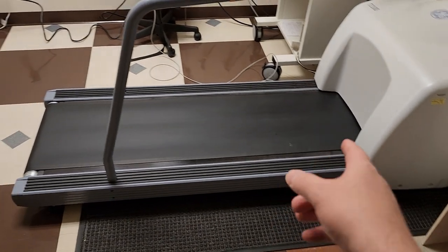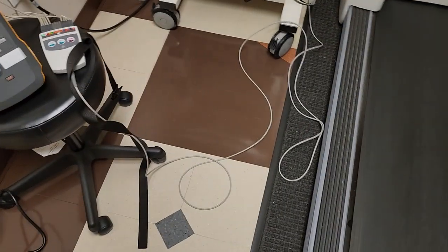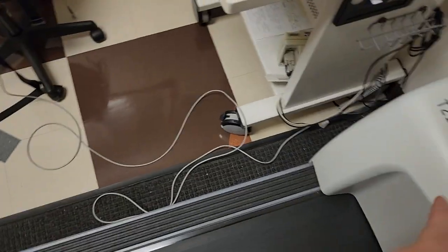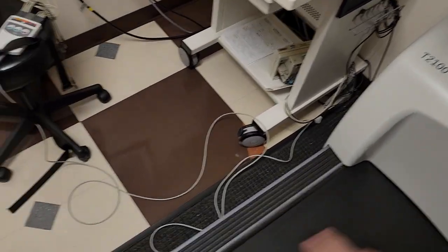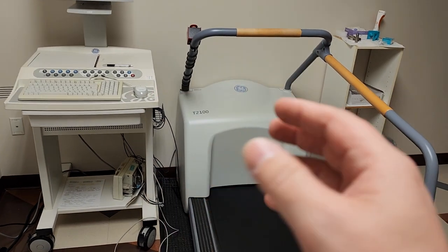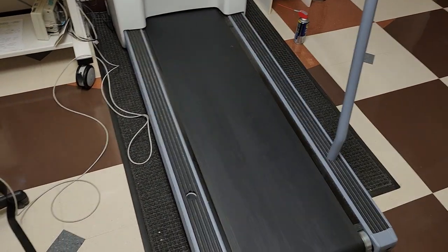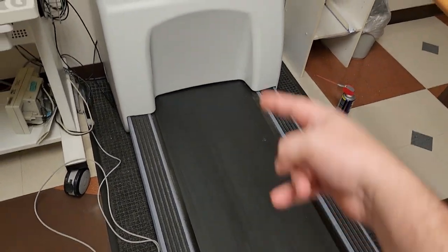I've already lubricated the belt in this area - mind you, it's going to move, and because it's going to move we'll need to do this multiple times. One of the first things I do when I walk up to one of these treadmills is push against the bar to make sure the treadmill is locked. It has a locking motor and you should not get any movement in the belt. If you do, the electromagnetic clutches are worn out and the machine won't pass, because it's supposed to stop and lock the belt so the patient won't fall. I've already sprayed silicone lubricant underneath the belt.